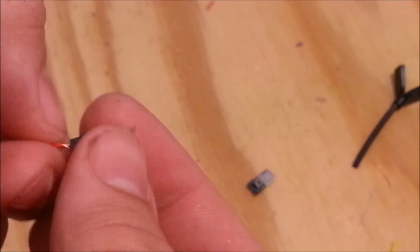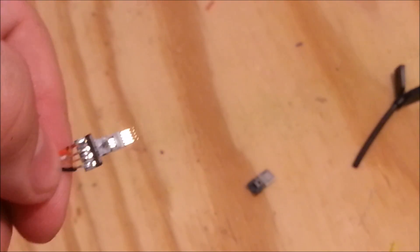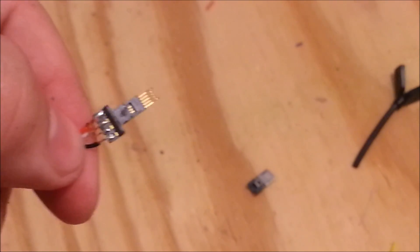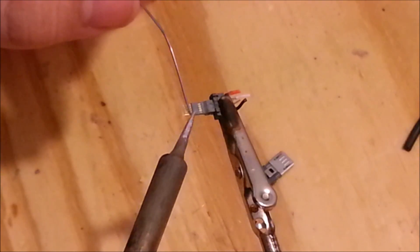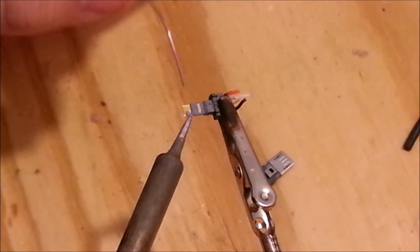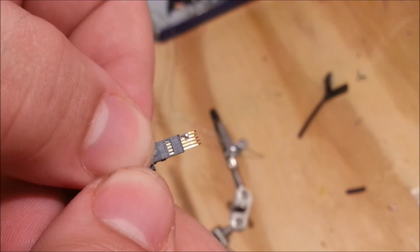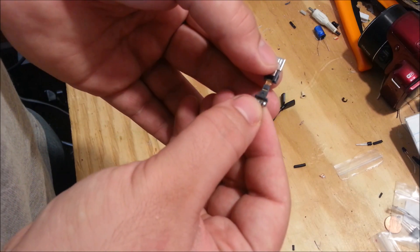Now to complete this mod, all you have to do is add a small solder bridge to the ground pin and the pin next to it — the sense pin. The ground pin can be identified using the black wire. Simply take a small soldering iron tip and create a small solder bridge. It's usually not recommended for a lot of situations, but this seems to be applicable.